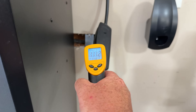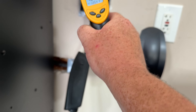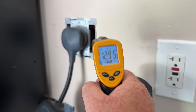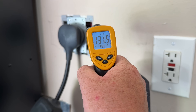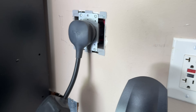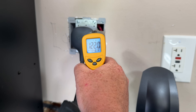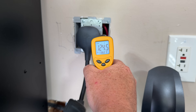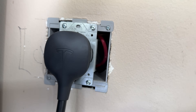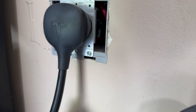The mobile connector itself, we are looking at about 128 degrees, which is pretty high. The plug itself is just about 130 degrees — that's very hot. What's crazy is if we take a reading of the actual back here, I was pulling 140 degrees — 145 degrees on the back here. The composite material behind it is just absorbing heat and not doing an effective job alleviating that. The wires themselves aren't too bad — still pretty warm, around 120 to 125 degrees, which is on the high side of normal. The wiring is pretty beefy, so the wiring doesn't appear to be the issue. But this plug itself is a problem.